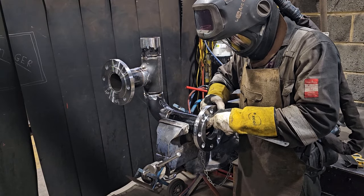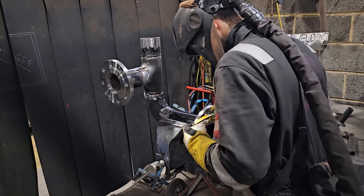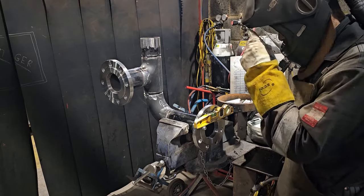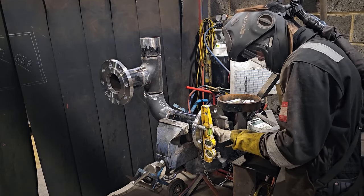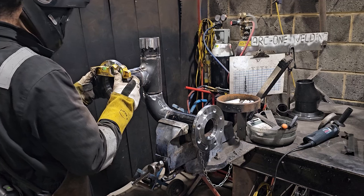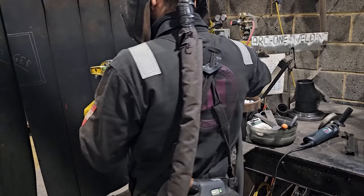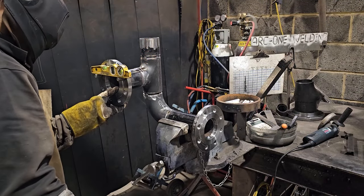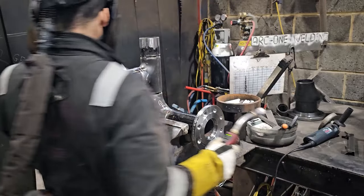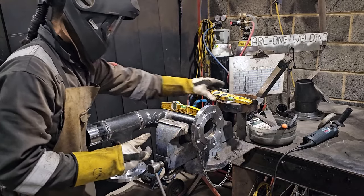This is definitely one that's going to trigger some of you - tacking flanges onto pipe that needs to be welded. I've seen the comments, you lot absolutely hate it. I refer back to what I've been saying throughout: speed and efficiency. I know I've got good tacks, my tacks aren't going to pull, and I know where to weld to compensate for any pulling. I know the limits of how many butt welds I can get away with without things pulling skewed. Everything is going to shrink on the inside of the elbow, so I make sure I start with everything as bang-on the mark as possible so that if it does pull, it still pulls within level.